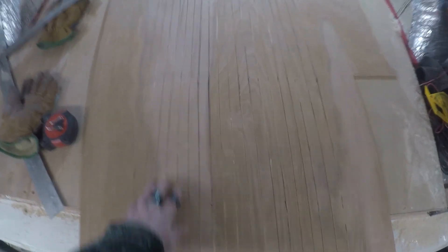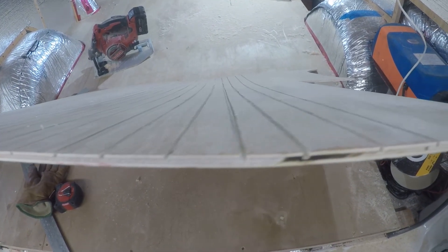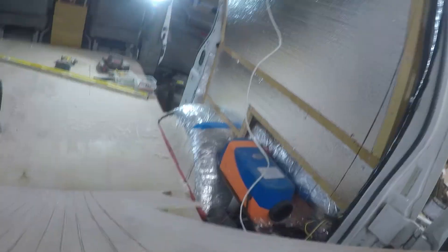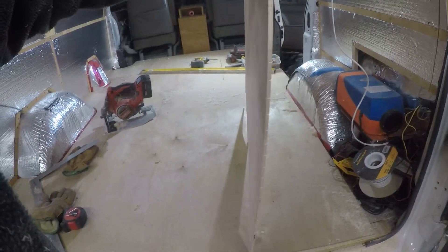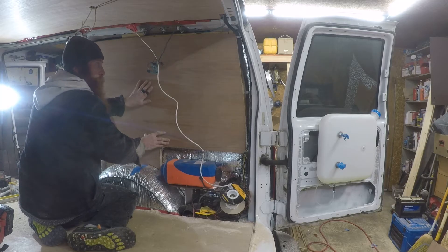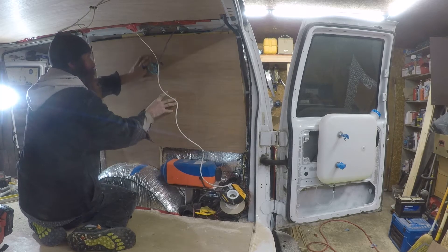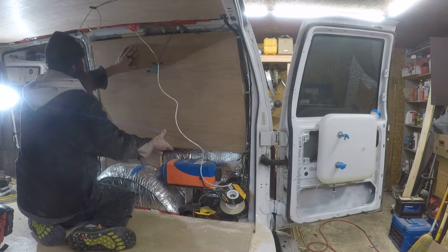Just due to the angles on this wall. I cut a groove every inch and it's about halfway through the board, all the way down. What that allows it to do is flex much easier. When I was doing that with the full sheet, I needed to get that curve and it just wasn't going to happen. Without very much pressure, I can push that right into the frame and then I've got a nice clean piece.